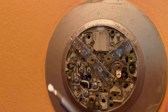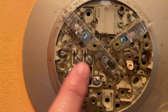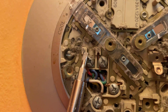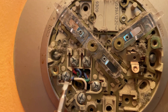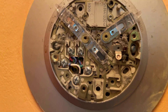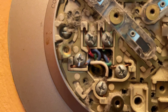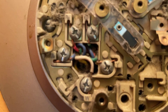Now this gives us access to the wiring in the back. We're going to turn our attention specifically to the wires right here. If you look closely, you can actually see labels for each wire: RH, G, RC, Y, and W. Before you do anything, you want to take a picture of your wires to make sure you have each of them saved, so when you wire the new thermostat you don't mix up the wires.